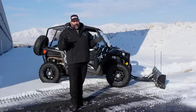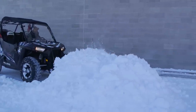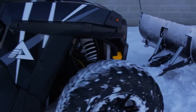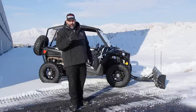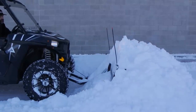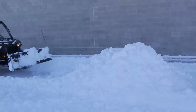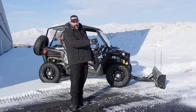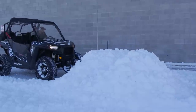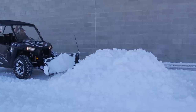The next part is piling. The smaller our yards and driveways get, the more important piling is — especially when you live in an area where snow keeps accumulating all year long. There are different ways you can do it. One of the easiest ways, if you have room, is you basically just stack it: you'll straight push into it, stop, and the next time you come you straight push again and it just keeps building up. It's not going to get very tall, it's just going to stay flat. As you're stacking and coming into that pile, you don't want to start lifting your blade until you start reversing, because the bottom of the blade is kind of scooped under the snow and if you try to lift it, you're going to break your plow rope. So back up before you start lifting your blade.